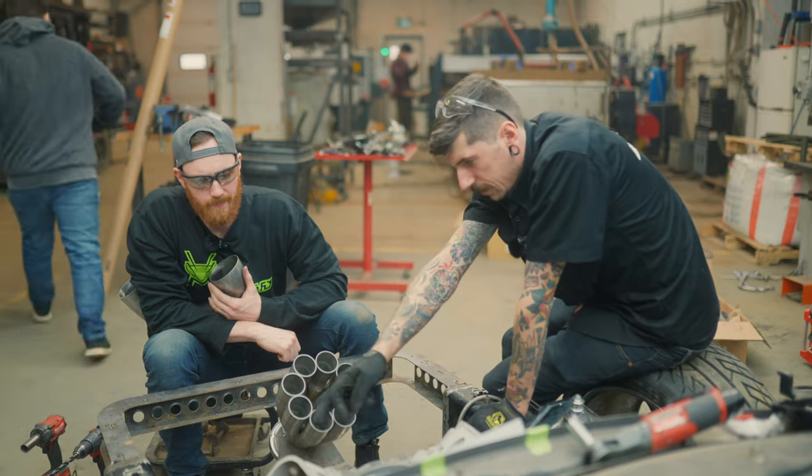That kind of gives us our avoidance regions. It tells us where the other runners are going to have to go. The whole setup is using engine plates, so we're trimming my mock-up plates to fit what we're doing, and then I will be able to make the final machine brackets using Dylan and our CNC machine after we finish the entire 8-into-1 system.